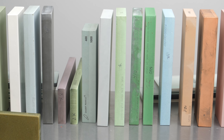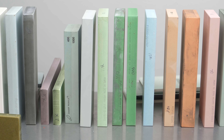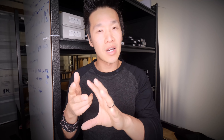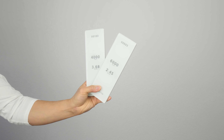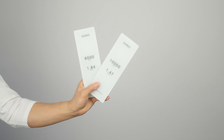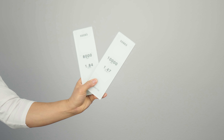The last category is polishing whetstones. This is the broadest range of whetstones, from 4000 all the way up to 30,000 grit. I put these grits in the polishing category because going from a 320 straight to a 4000 or 5000 doesn't give you a really good edge — it looks polished but it's not very sharp. So 4000, 5000, and 6000 are your medium-fine polishing stones; 8000 to 12,000 are your fine polishing stones; and anything over 12,000 is your super or ultra polishing category.